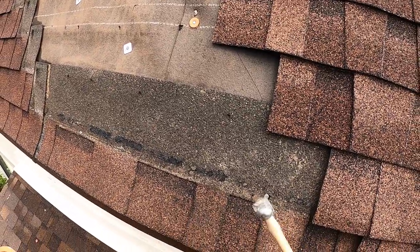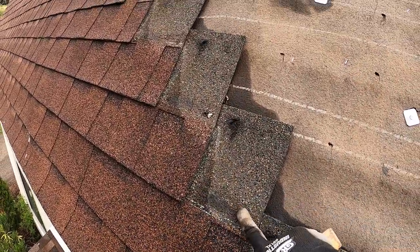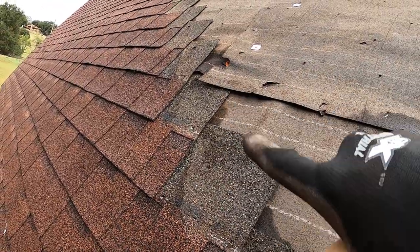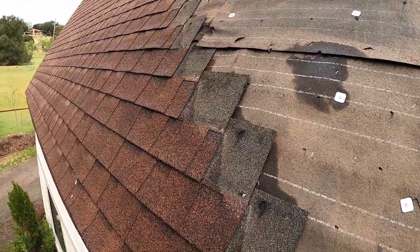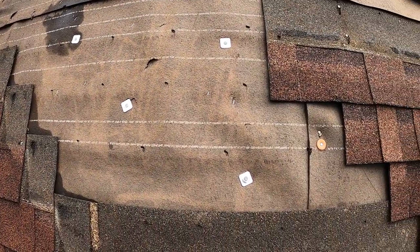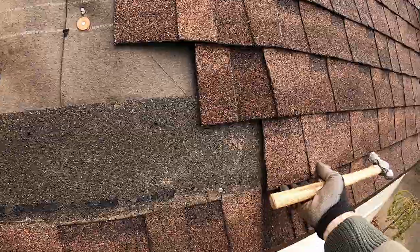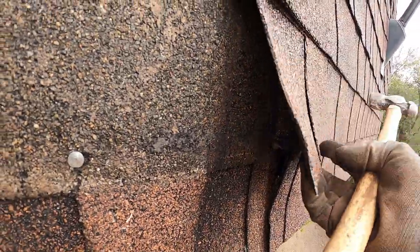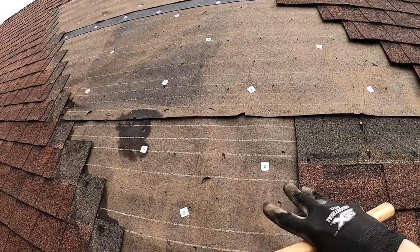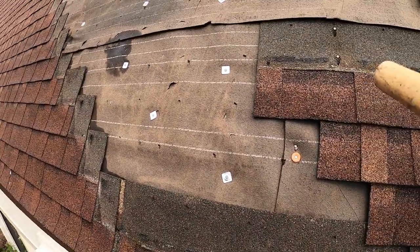So we got that first row tacked in with the 1 3/4 inch nails and holding tight. So for our overlaps for the existing rows that did not fall off, we're going to go ahead and replace each one of these nails going up, popping them out, and putting in the 1 3/4 inch. Now, ideally, this whole roof needs to be redone. And like I keep reiterating, this is just a quick temporary fix because we're often limited by money, time, and other resources. So we're gonna do the best we can, especially on the sides of our patch, to get in 1 3/4 inch nails wherever we can, along with all of the tiles we're reusing that we have here in the boom with us. And I'll give you an update here in a minute, guys.